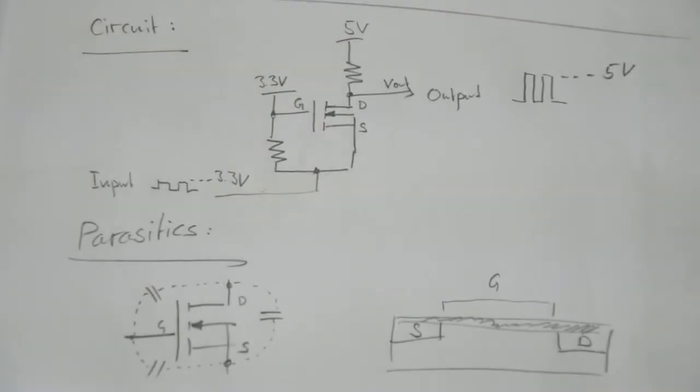To summarize the results from this experiment, there are really 2 things we learned. First, apparently while this circuit works fine at lower frequencies, the output signal starts to degrade when you step up the frequency. Second, for some weird reason, the output voltage is actually about 250 millivolts above ground, when it should be 0 volts.